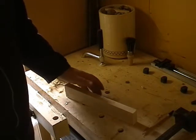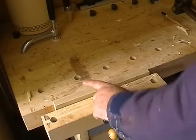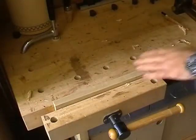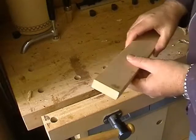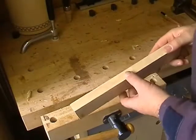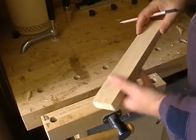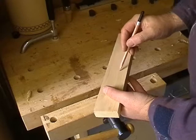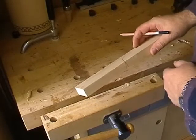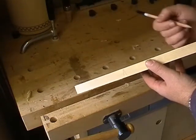Before I mark it and call it that, I'm going to give it a quick rub with a plane. Having chosen what I consider to be the better edge, three rubs with a plane — not enough to set it off the square, but enough to clean it up. From that edge I'm going to look at the faces and choose which one to use as a datum, then put the marks on. It's a loop and a V: the V pointing towards the face side, the loop tailing towards the face edge, meaning this edge now becomes my datum edge.